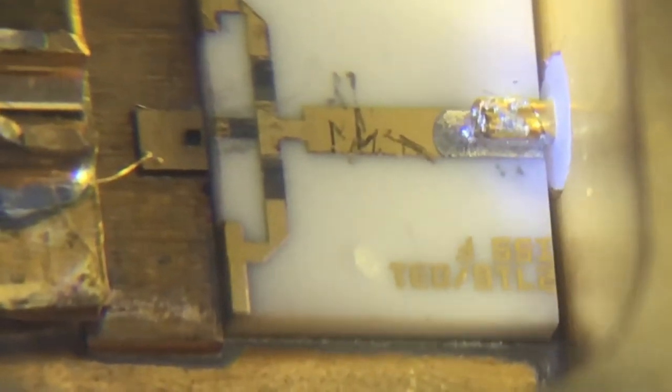You can see the bond wire going off to the pad, but there's a bond wire that's meant to go from — if you look right in the middle of that trace coming from the right — there's a piece of black resistance material in the horizontal plane which then goes to a gold track. There's meant to be a bond wire that leaps from that gold track to the top of that black square which is the diode, and that's missing. I've looked at it under a microscope and it's incredibly difficult to resolve.